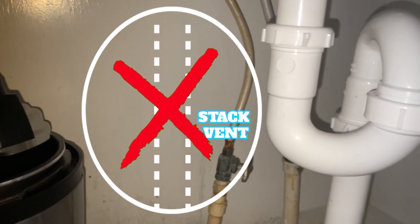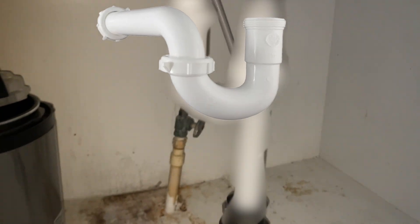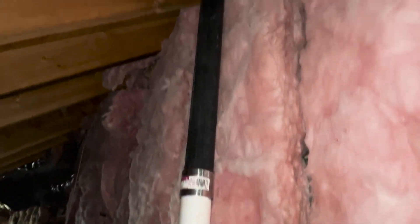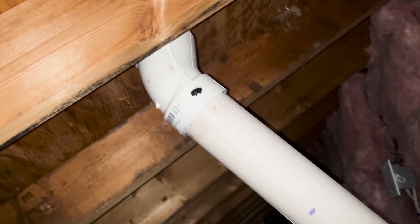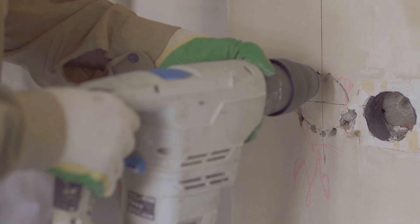It's almost guaranteed that you don't have a stack vent by your plumbing fixture location, otherwise you would have a P-trap there. Typically it's built inside the walls and extended to the outdoors through the roof. It's considered a traditional and superior venting system, but you're going to need to replumb the entire line, cutting walls and roof, in order to run a P-trap with a vent stack.